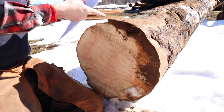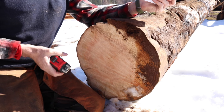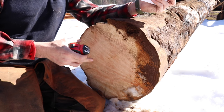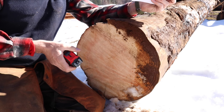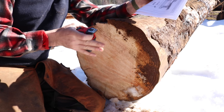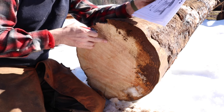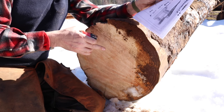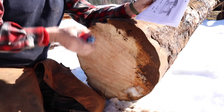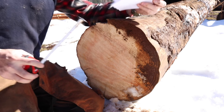What we'll do is we'll over-cut this — we'll cut this 8 feet 8 inches. The reason for that is when we're cutting these, because we want 8-footers, we don't want it to be exactly 8. Usually loggers and sawmills will over-cut between 6 and 8 inches, so it gives you a little bit extra to play with. It's really nice for timber framing, because if you're doing joinery and you find a little knot right where you're working, you have that 6 to 8 inches to shift back and forth, and it gives you plenty of room to square up the edges.